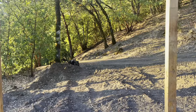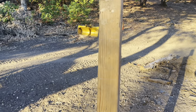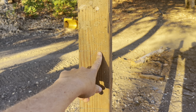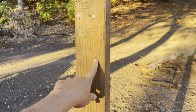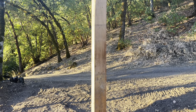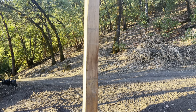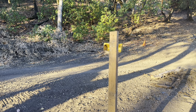I've slept on it, and I have decided to go ahead and follow through with raising up my pitch measurement back here to a 3 and 12, but it's actually going to work out to be a 3.5 in 12, because along this back wall I have a middle post, which means that I'm going to have support for my header every 6 feet, which means that instead of using a 12-inch header, I can use a 6-inch header. So I'm excited about that. I'm going to be able to kind of meet in the middle there with my ceiling height and my pitch.